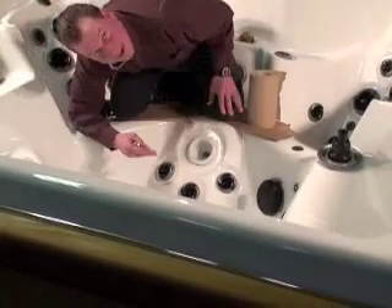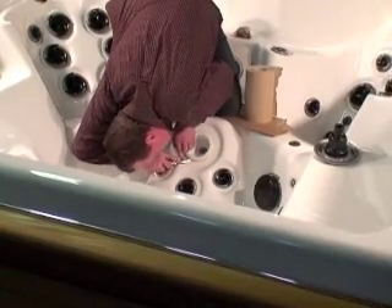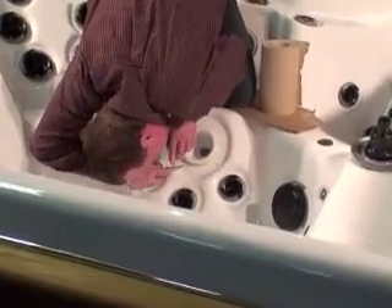So what you're going to want to do is take a knife or a dremel tool — if you're careful, use a dremel — and clean up any abrasions that are in the area, so that you have a nice clean area for applying a new bead of plastic weld. We've got that all cleaned out.